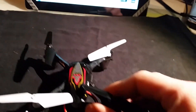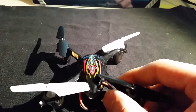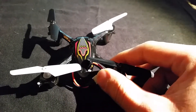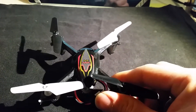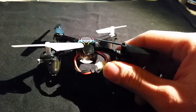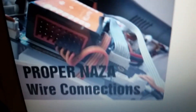Start it up and if you tilt it forward, instead of trying to come back in balance — naturally what the drone should do is, if you tilt it forward, the rear two motors should spin harder to bring it back in balance. Instead of doing that, it does the opposite: those two spin harder when you tilt it over, so obviously it's going to flip.